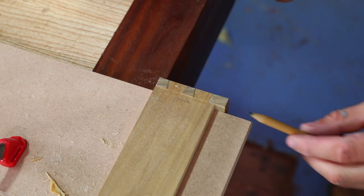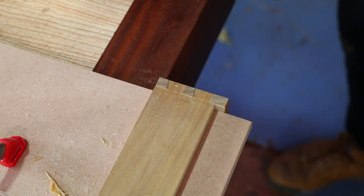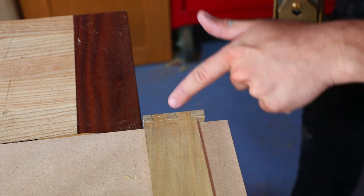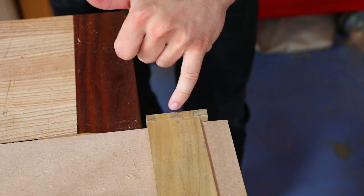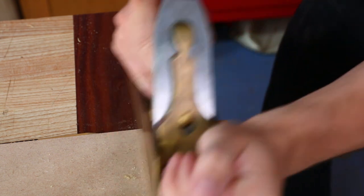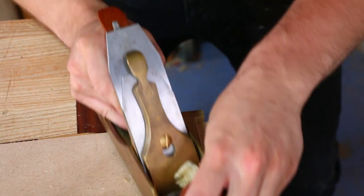The longer faces, however, require a bit more care. On this top edge we've got some unsupported end grain, so even if I plane through to midway, if I catch that back edge the end grain is going to break out — and that will be very prominent on the front of the box. What we're going to do with this top edge is come in from the top and then steer it back round so that it's in line with the side of the box. The end grain poking up may get in the way, so I'll flush off the ends of these two pins first to get them out of the way, then steer carefully as it comes onto the box.